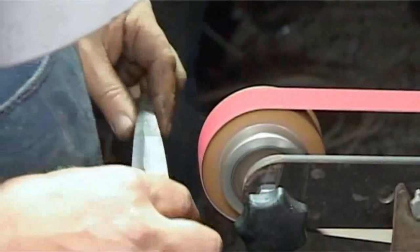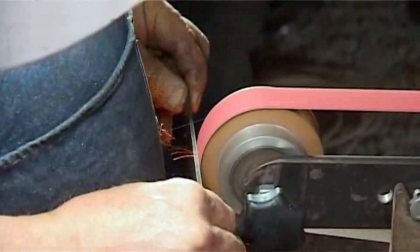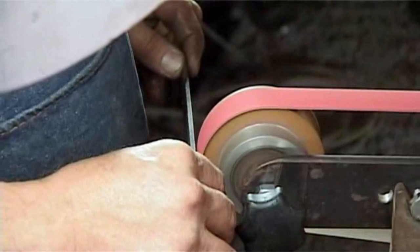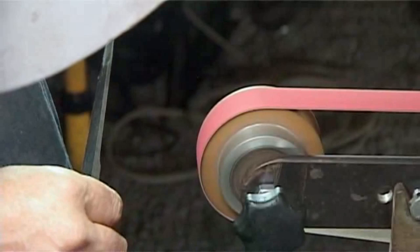Okay, now if you can put it on the ground, it's good. Yep. All right, so there I'm blending out. As you apply pressure to the belt, come down. Imagine you're an aeroplane touching down on a runway. You're not just bouncing down like a helicopter. You approach the belt as an aeroplane on a runway would, gently, at motion.